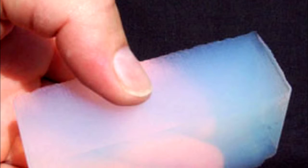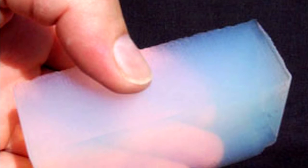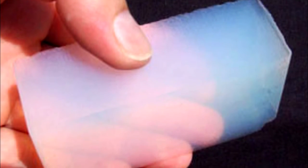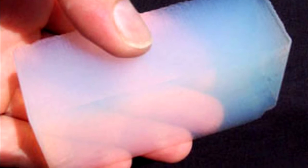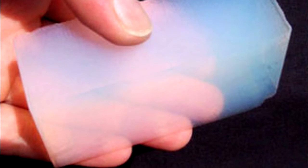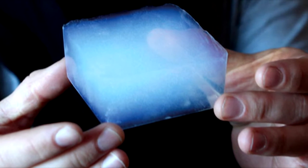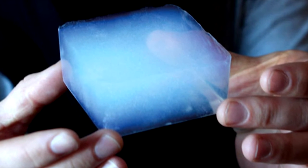To further insulate electronics, sometimes a layer of aerogel is used between the MLI and the electronics box, which houses the components and circuits that form the brain of the spacecraft. Aerogel is a solid, very lightweight, very low-density synthetic material with low thermal conductivity. It is composed almost entirely of air at 98.2%, which makes it a very poor heat conductor, and air cannot circulate through the material, which reduces its convective properties.